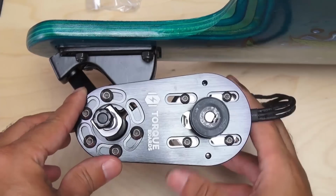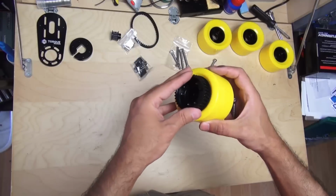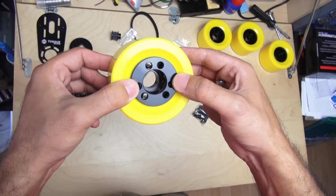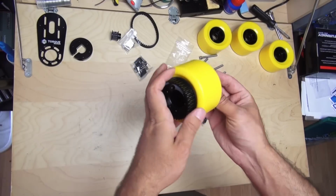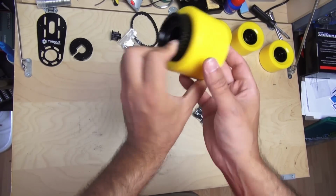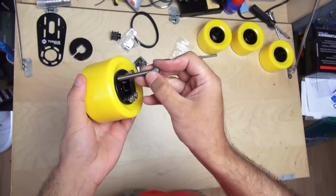When attaching the drive wheel pulley, you can immediately apply Loctite. It's also best to fasten the screws on the drive wheel pulley all at once and gradually. If you fasten each screw completely and then move to the next one, chances are good that the last few screws will not align and you'll need to start all over again.